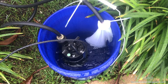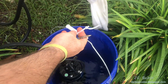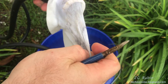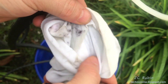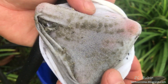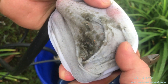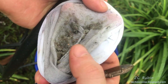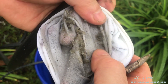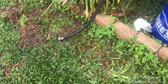At the 90-minute mark it's time to shut it down. Unfasten the hose from the bucket and remove the cable tie holding the nylon filter from the end of the hose. There's definitely some debris weighing it down in the bottom — and there it is: a whole bunch of stuff came out of the unit. A lot of the solids were dissolved by the acid, but this is the remnants. I'm just glad it's no longer in my heating unit.